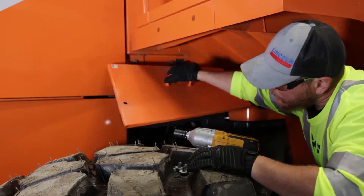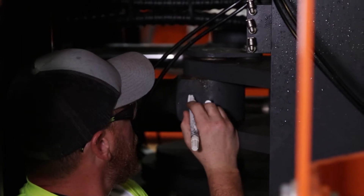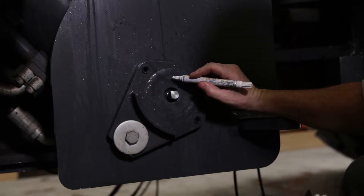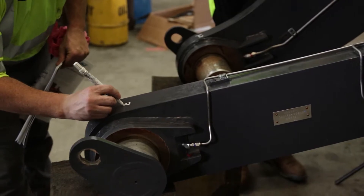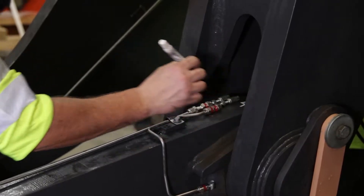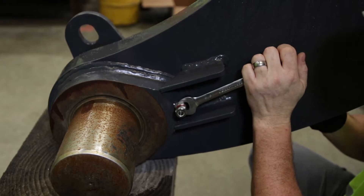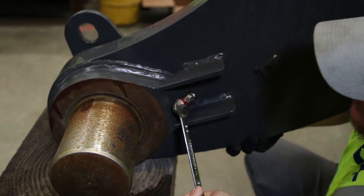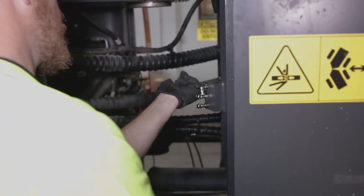Remove any cover panels that might hinder access to mounting and routing locations. Locate and mark all hardware mounting locations and lubrication points on the loader using the supplied system diagram. Identifying each lubrication point and component mount position beforehand sets up installation of the correct fittings at each lubrication point and feed line routing to the correct location on the machine. Remove each hydraulic lubrication fitting and install the appropriate adapter outlined in the manual diagrams. It is important to tighten and orient the fittings to match the supply and feed line path to the endpoint so hose and tubing are out of the way of moving parts.